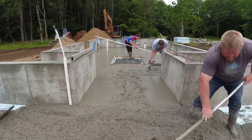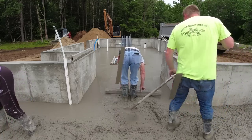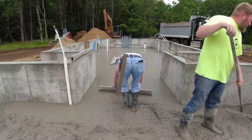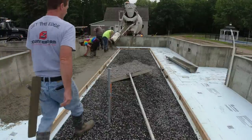Me and Tia are going to stay here and finish this by hand — I've got a little bit of that on the video coming up. They wanted a smooth floor so it would be easy to clean, easy to sweep, and easy for the water to drain into the pits. But they didn't want it power-troweled — what we call shined out like glass smooth. That's why Tia and I ended up just finishing it by hand with a mag and a steel trowel.